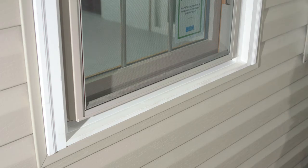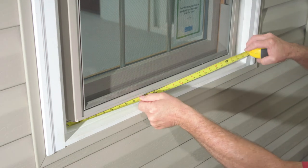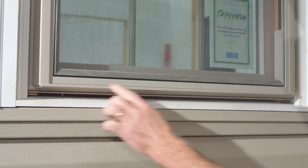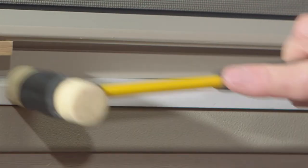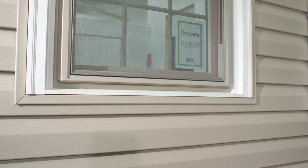Now we're going to move to the exterior of the window to install the sill extender. The sill extender installs in the accessory groove in the bottom of the window. You will receive a full extender that you'll have to measure from the accessory groove to the sill angle, and then go ahead and rip that down. Once you've ripped it down, you can insulate under that window. We want to make sure that the window sill is not bowed after the installation process, then we can go forward with installing the sill extender. Thanks for watching our informational video on installation of double-hung windows. For more information, please visit Provia.com.